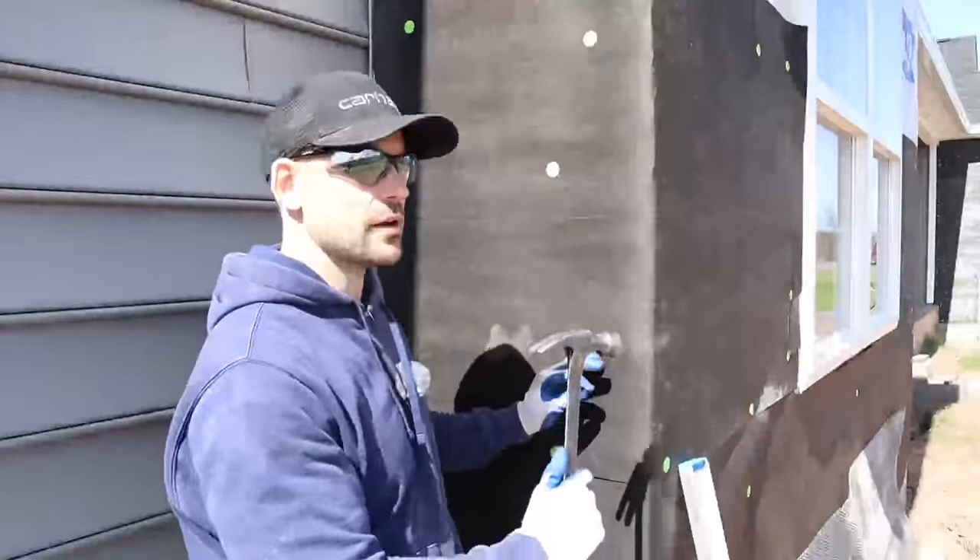I notice it's still really dry so I'm going to add some more water. If you take a look, see how it's kind of like peanut butter — it's thick but not super thick or cakey. Something like that. Now that I've got the right consistency I'll mix this up for just a few more minutes. After I'm done mixing, I hold my trigger down so it throws the mortar off as I lift it up out of the five-gallon bucket, then I place it in water so it doesn't set up — run it forward then backwards, and it's nice and clean.